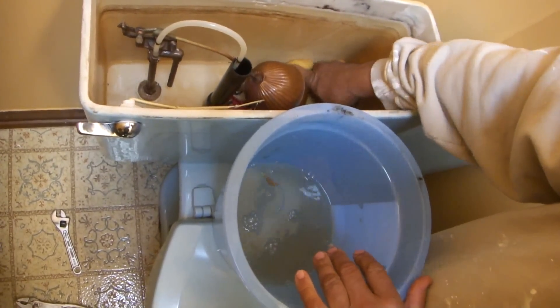I'm going to start tightening up these nuts and try to make this tank look even. Today's toilets move a lot more than the old-style ones — they're made to last a lot longer. Tighten them up and try to get this tank to look level across here. They don't have to be super tight. Anybody can do this. I'm tightening each side separately at a time.